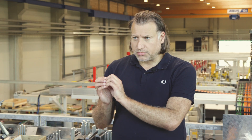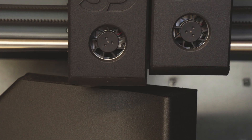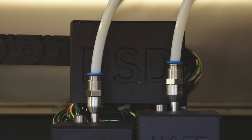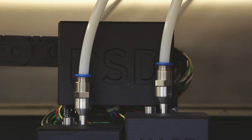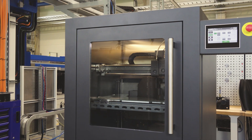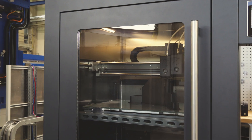Our masterpiece is the DSX printhead. It's a very special printhead we have engineered. We are using double synchronized feeding wheels. We have integrated cooling channels to cool down the filament and avoid softening of the filament before feeding in a heated chamber. Therefore, we can print filaments with a shore hardness of 60A, and we can print with the same printhead high-performance materials like PEI.